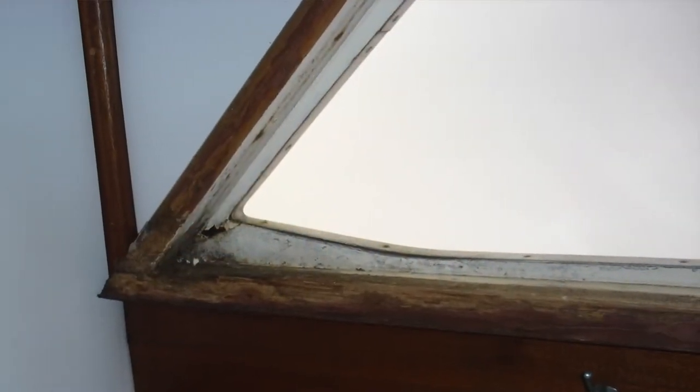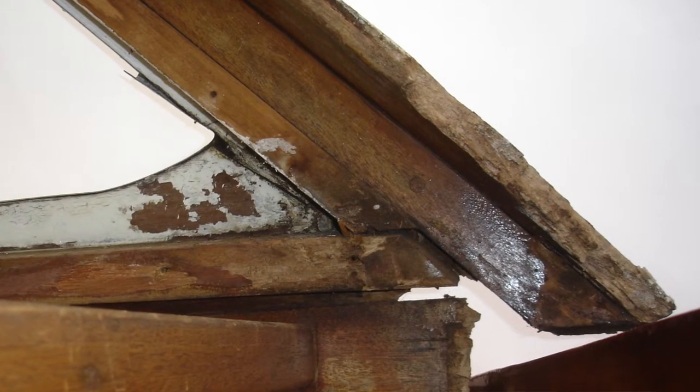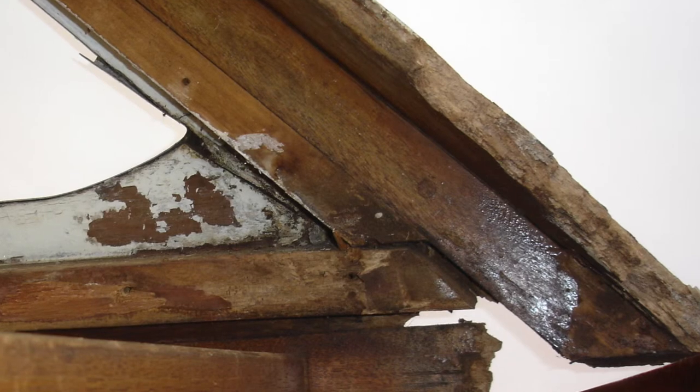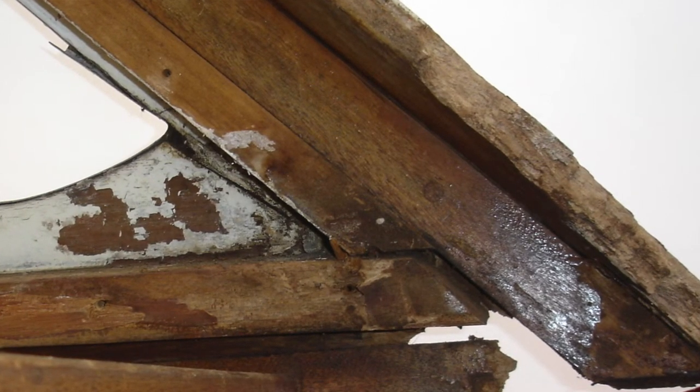Once I got them off, I also noticed that the front window post, this was on the port side mostly, the window trim that surrounded the opening for the window on the outside never lined up quite right. It overlapped and it was weird. And I could clearly see what the problem was. You could see here that all of the pieces of wood in this photograph should be touching. There should be no gaps. And so the forward window post was sliding forward. It was probably forward about 3/8 of an inch or more.